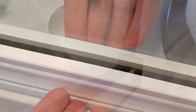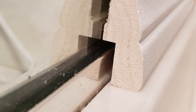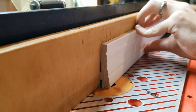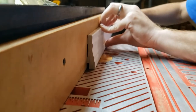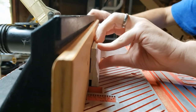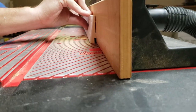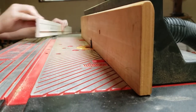The easiest solution is to remove some material to make way for the clip. This could be done with a table saw, but I picked up a second-hand router table about a year ago and had never used it, so this seemed like a nice chance to test it out. I set the depth and width, trimmed out a little slot, and used scrap pieces to test sizing and adjust as necessary. Once I had it set right, I did the main boards — in two passes so I wasn't taking off too much at once.